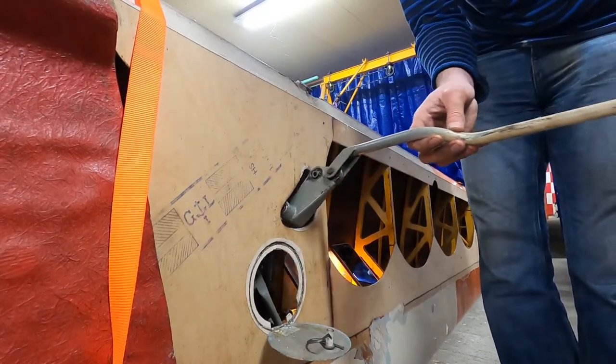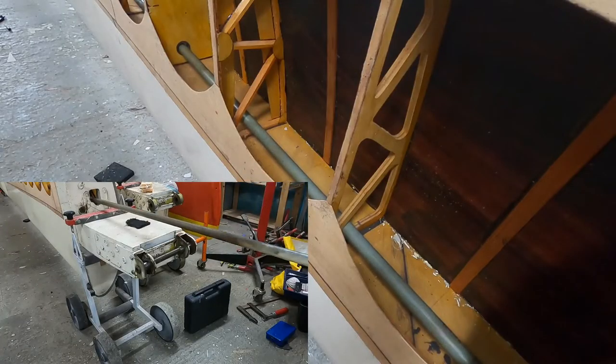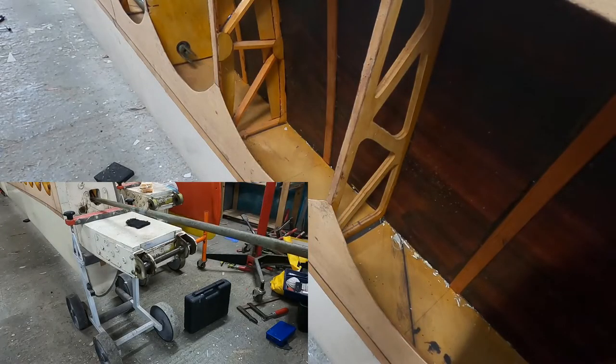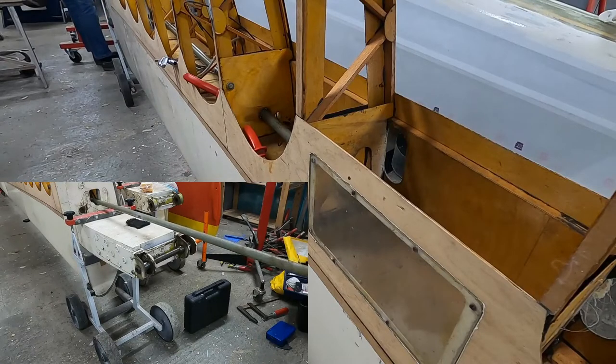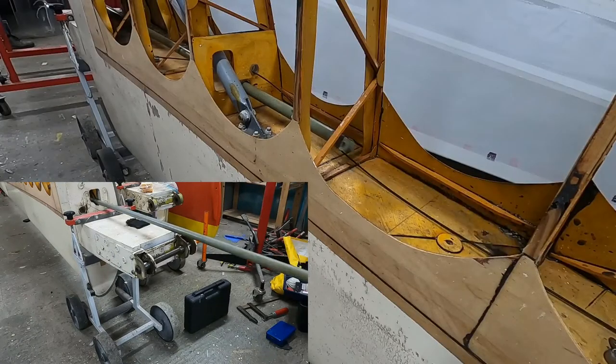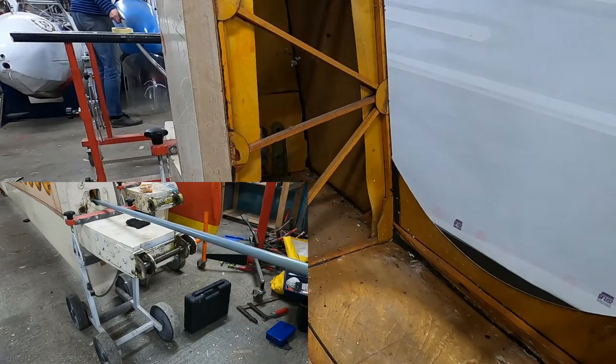Having learned from this, undoing the control rods for the other wing was a lot easier. This time I removed the short control rod with the bell crank still attached. With this done, the long control rod can be pulled out of the wing. The rods are supported by felt rings in four locations in each wing, which act as linear bearings. At some point someone was a bit enthusiastic with grease, which is why the control rods look so dirty. It isn't rust — it's just a lot of dirt stuck to it.